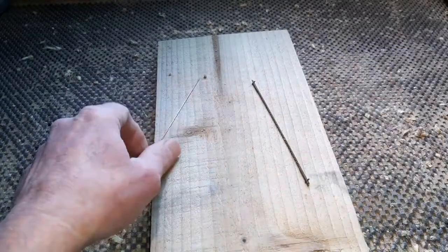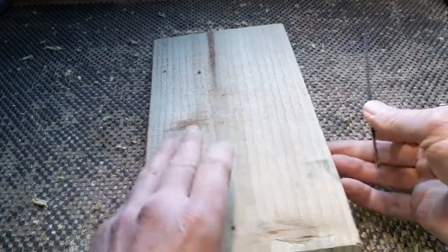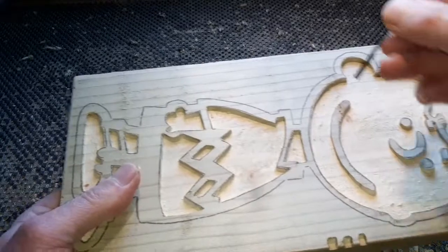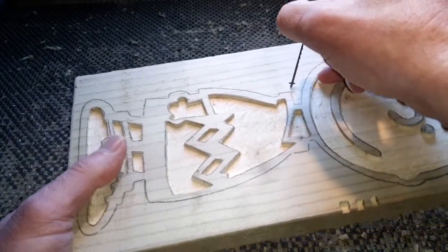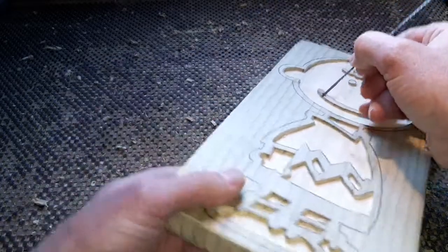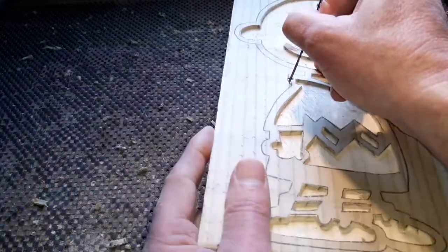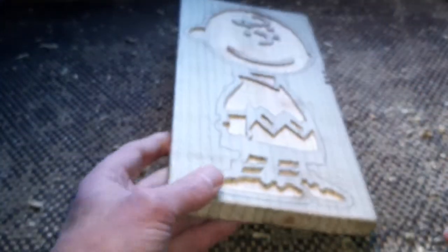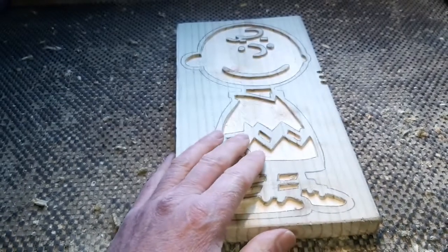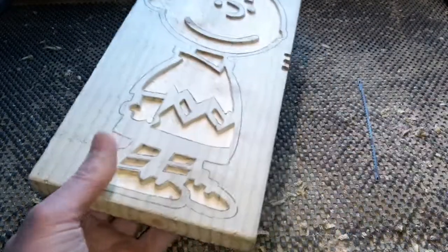Whereas if you're using one of these other two blades, you can only cut as you're pushing the wood away from you, if that makes sense. So if we were to start there, we would come down to there, and then we'd have to turn the wood, do that little section, turn the wood, do that section, turn the wood, do that section, and all that. There's a lot of turning and twisting. Some people can do phenomenal work with the straight blade. It just doesn't work for me.